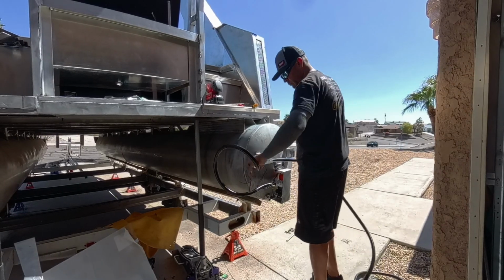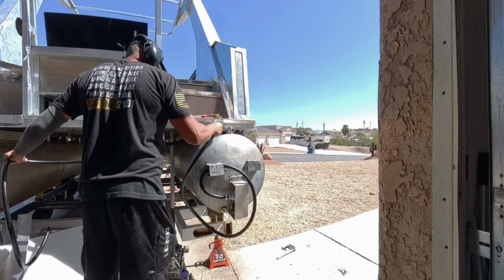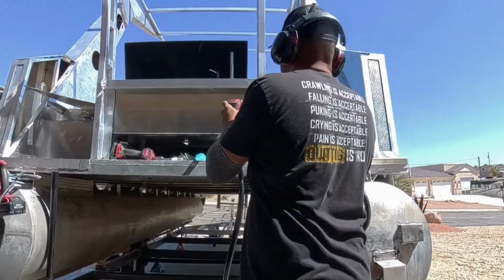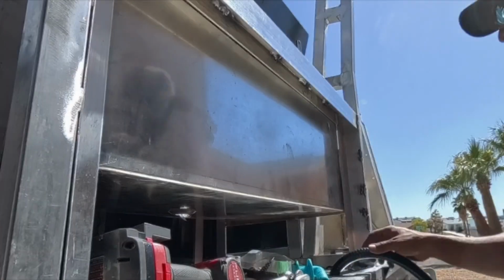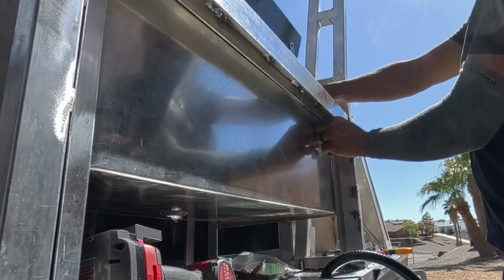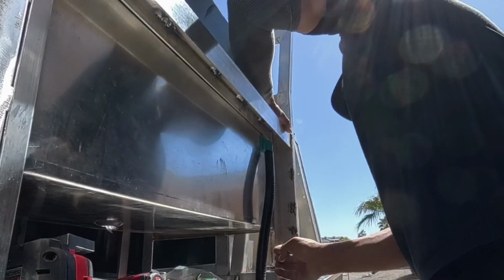They had these brackets back there where our ladder used to be. We're no longer going to use the stock ladder. It couldn't even convert to our new design if it wanted to. So we're just going to use it to bracket and hold the hose in place. I drilled a hole on the side framing of the pontoon, but then I forgot that you could just put the hose right over the tube between the framing. So then I just rerouted it, and I drilled a hole through that metal piece that we installed earlier and used that to route the hose up.